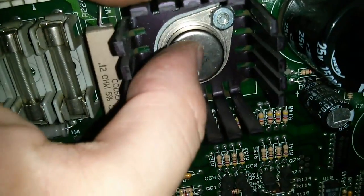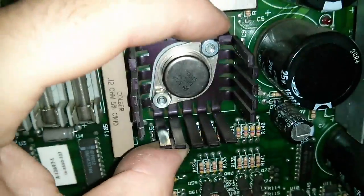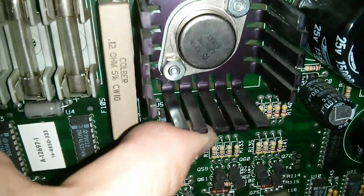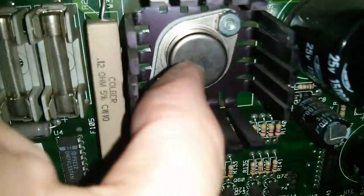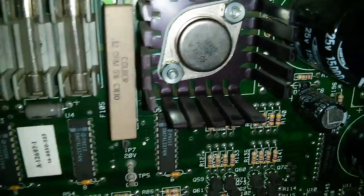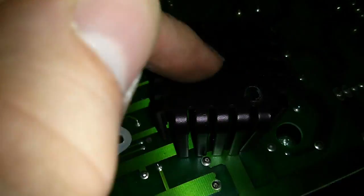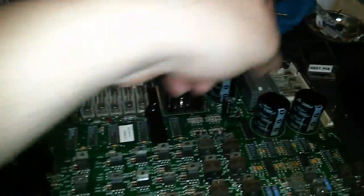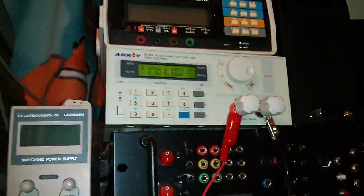I think what I'm going to do is take this off and put some heat shrink on those legs, just to make sure there's no way that it can short out. Because if someone puts it in the cab and bashes it, it could tuck the legs and short out the regulator. I'm not sure how they lined these up from the factory - it's literally only a couple of millimetres of movement for it to be a short. So I'm going to add some insulators on now myself. We've got some little insulators on the legs now which will fit through those holes and provide protection from the legs touching the metal.